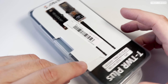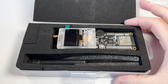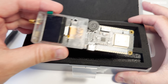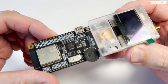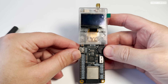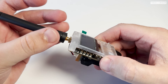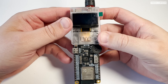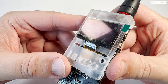Hi and welcome back to another TechMinds video. If radio-related gadgets which incorporate onboard MCUs interest you, then this is for you. This is a Lilygo T-TWR Plus Revision 2. This particular version supports VHF, but there are actually four different versions available which I'll go over shortly. The onboard MCU is an ESP32-S3 and the onboard radio device is an SA868 with firmware pre-loaded. The onboard display is a two-color 1.3 inch OLED which is fully customizable within software.